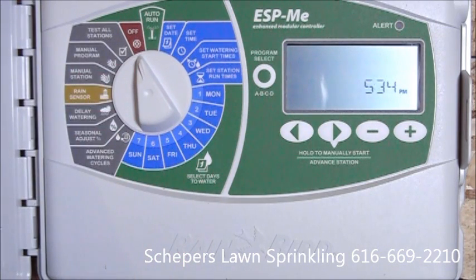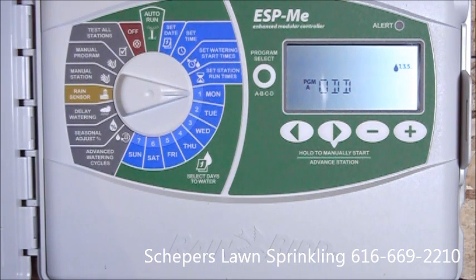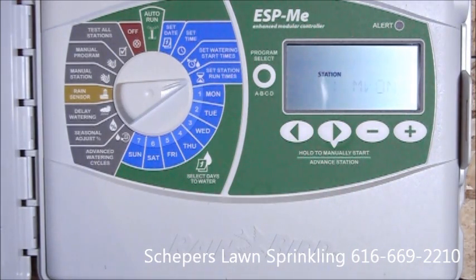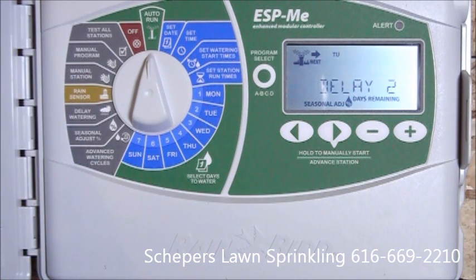The final button is off. The irrigation controller will no longer run in the off position. One unique feature of this irrigation controller gives us the ability to use or not use a master valve. A master valve, in many situations, is used for turning on a pump, turning on fertilizer injection, or turning on iron removal. We'll go to set station runtimes and hit the two arrows — it currently says the master valve is turned on. If we would like to turn it off, we simply hit minus. Now the master valve no longer works on this specific zone. In most situations throughout the summer watering months, we leave the clock on auto or run.